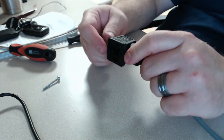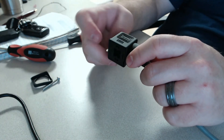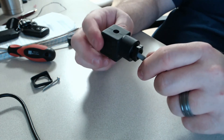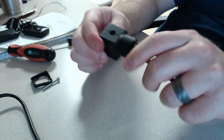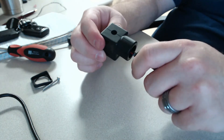Make sure that we don't lose the screw. The bottom of your connector may also have a rubber gasket — go ahead and pull that off and make sure we don't lose it. This strain relief right here clamps your cable in place and provides strain relief for the wires. Go ahead and loosen this clamp; if it's tight you may need a pair of pliers. Loosen it and pull it clear back out.